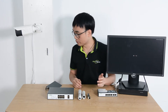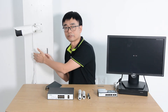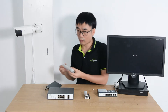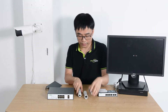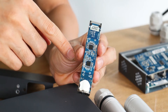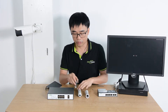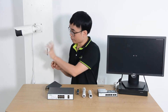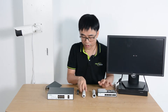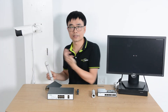The switch can send a long distance network signal to the edge device like this IP camera. But for a regular camera, if it needs to return the signal, it also needs a long distance chipset. That's the reason why we need the PoE adapter. If you take off the PCB board from this PoE adapter and look closely, it has a very similar design — these two chipsets are also long distance, which help the camera return the signal. So, if we need long distance, we need ports that support it, and we also need to install a PoE adapter at each edge device so it can return the signal.